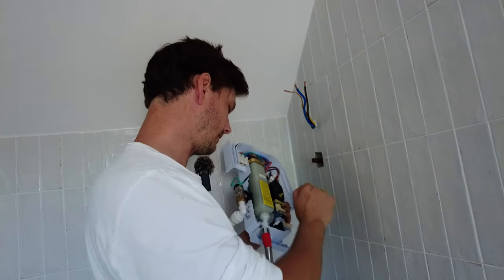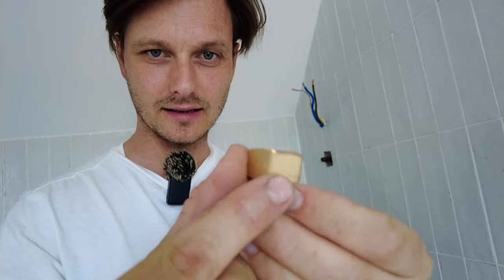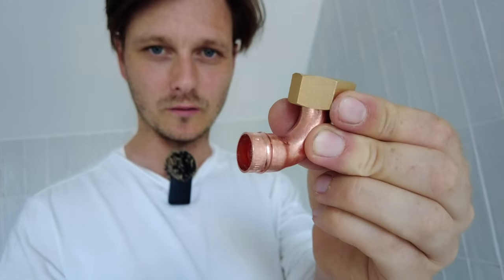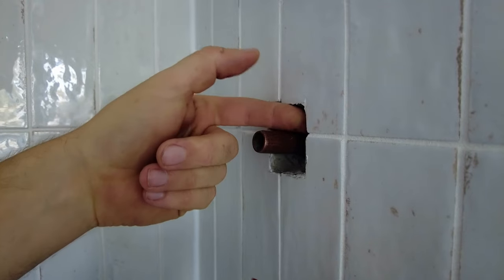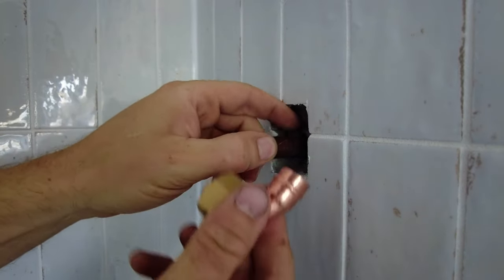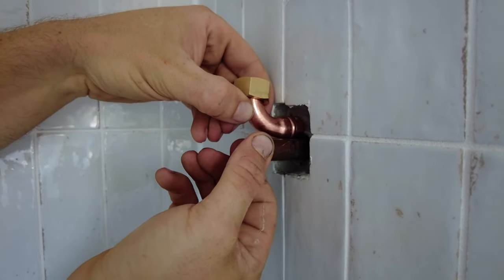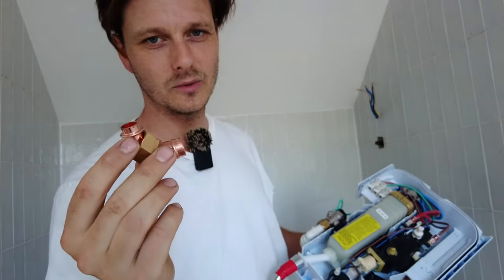Anyway I've done it like this - I'm not digging that out. So my next option would be this one. Tap connector there and that is a solder ring. So this is going to hang about 12mm out the back. This tile here is about 9mm, then with the adhesive basically 12mm, so I need to get it all the way back to there. So I need to solder this in here without setting fire to anything or just going wrong. Hopefully this is going to work out. Maybe I could have put it on before but I didn't know I was going to have to get this - I thought the other one would be all right.